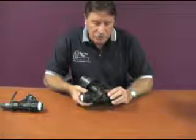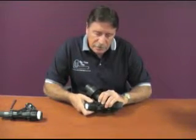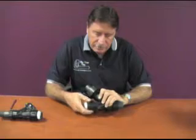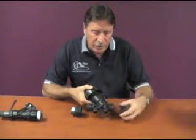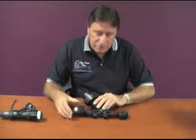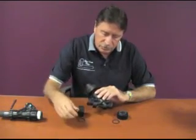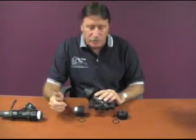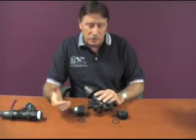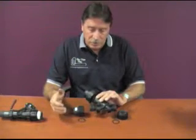The valve also has the option of adding a limit stop and a position indicator on top. The K530 series is made with true union ends — so if you disconnect either end, this valve will come right out of the line and slide out. There are O-ring seals on each side. So this valve slides out similar to a true union type ball valve. If you ever have a problem — it's cracked or whatever — and you want to replace the valve quickly, you can just buy a replacement valve, pop it in line, put your nuts on, and away you go.